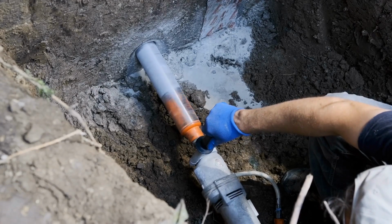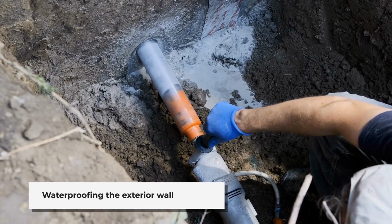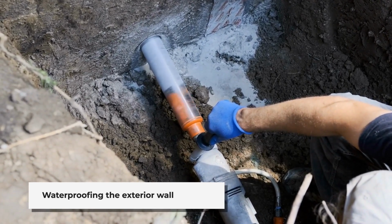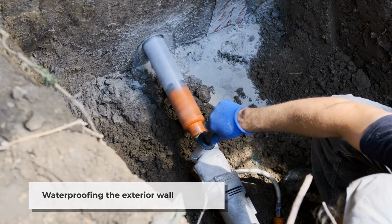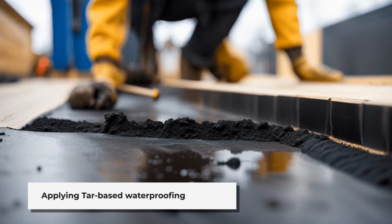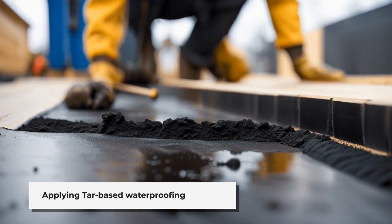Follow directions for the cement, and clean out loose stones or cement before applying this product. Paint the outside wall with a cement waterproofing sealer. After the wall dries, brush on a waterproof paint sealer used for outside walls. This needs to be dried thoroughly. Pitch the wall with a tar-based product. Use a tar-based pitch and trowel the product onto the wall.